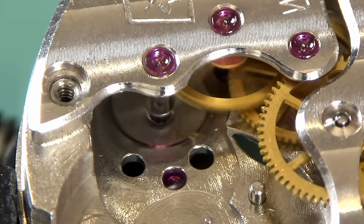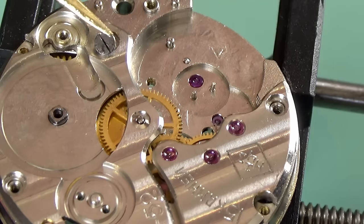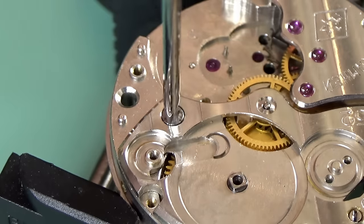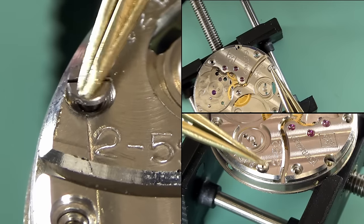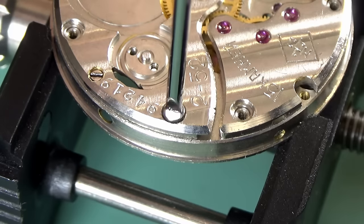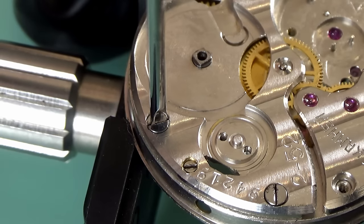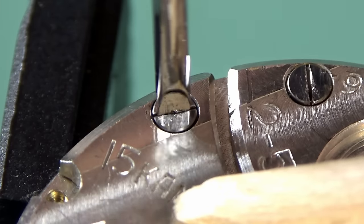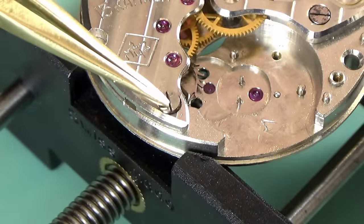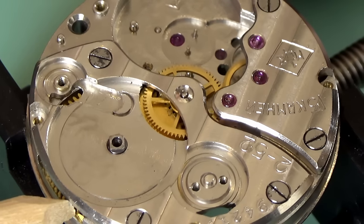This is definitely a hobby for people who like buying more and more bits. With everything in place you can tell the pivots have engaged with the top jewels - I'll give the barrel a little spin just to make sure everything is spinning. Those pivots were pretty loose; this watch is 70 years old, so I wasn't expecting major miracles. I think this one is from 1952. Normally throughout the process I'm cleaning with Rodico - it's like a blue tack for watchmakers that doesn't leave any residue. This is the second quarter of 1952.